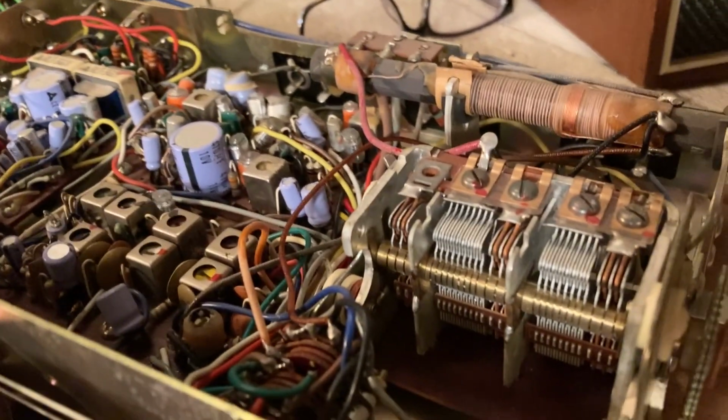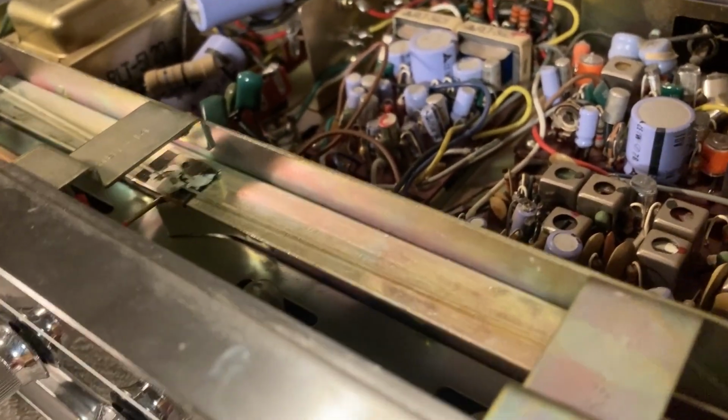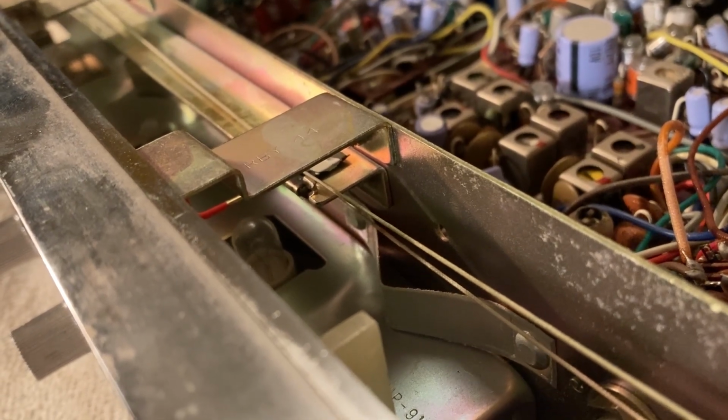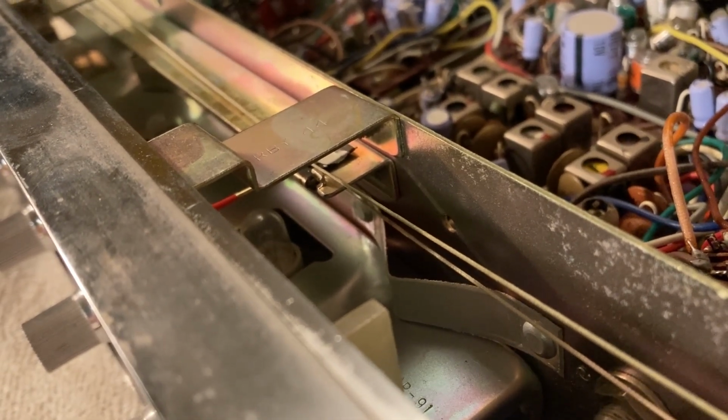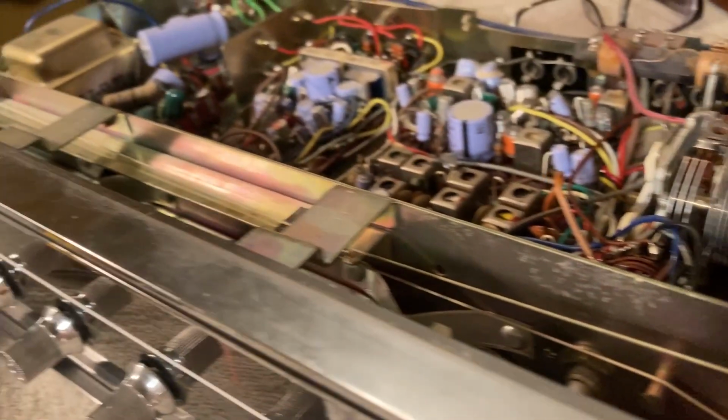And that's with it fully meshed, which is at maximum capacity. The capacitance of the capacitor is the highest whenever it's fully meshed. It's important to know, because you don't know how they're going to say it. I might have had to Google that earlier. And then when it gets down this way, it also doesn't quite hit the stop. It's real close, it's right there on it. So I don't know if this gear moved or if they restrung it or what happened, but I think we're good now.